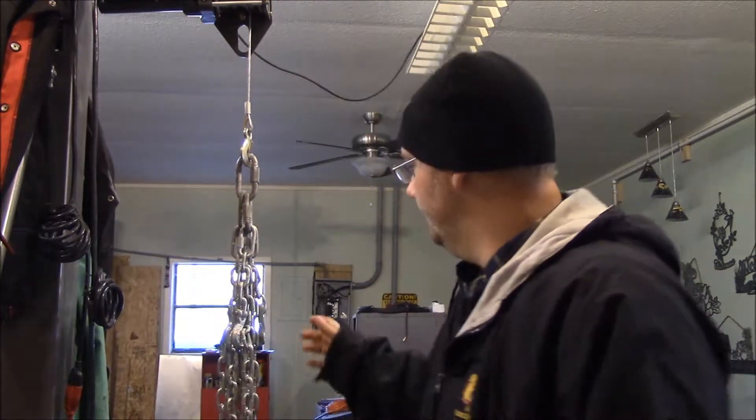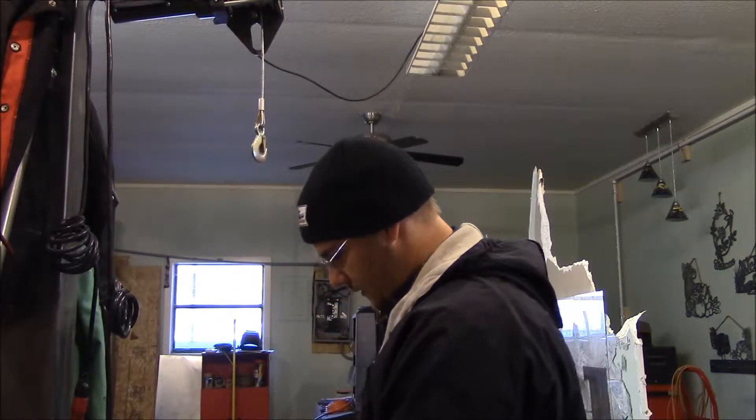Mine is by itself single-line rated at 1,500 pounds. When I put in this second layer of wire, it's going to effectively allow it to max out at 3,000 pounds. But realistically, I have a heavy lift coming up and I just want to have 500 pounds on this line instead of the full 1,500.